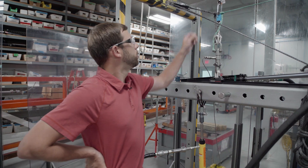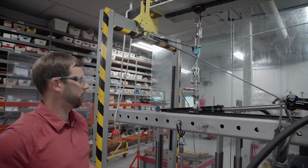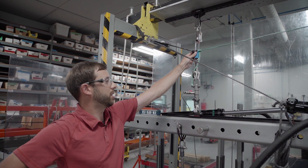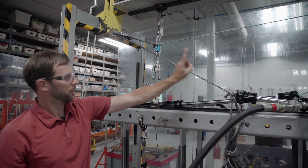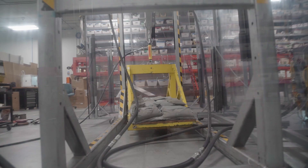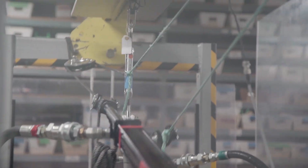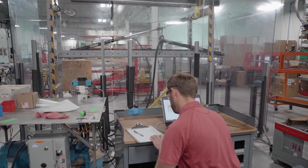I've got two cars here, both loaded with identical sets of rollers, a load cell in between, a turnbuckle to adjust the tension, and then two hydraulic cylinders — one to pull the car each way — and a lot of lead weight hanging. My goal is to get it to average about 80 percent of max working load, which is typical for when we cycle test things to determine their longevity.